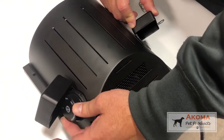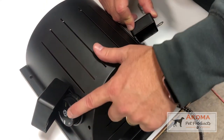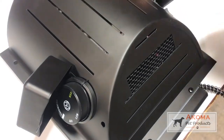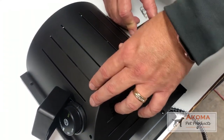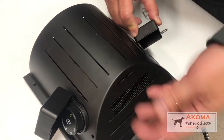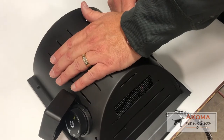If we manipulate the thermostat dial to a higher level — say we're set on medium, around 55 degrees — the unit is now telling it that it's colder than that in the ambient environment. So it's telling the unit: we're at 55 degrees, the ambient temperature is colder than that, so fan turn off, heater turn on. Right now this heater is on and this unit is heating up.